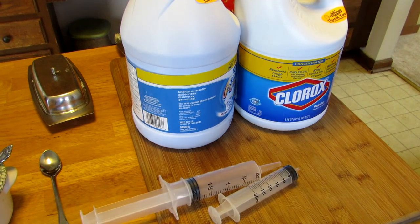And you want to smell the chlorine come out of the faucets and stuff. And then once you get the smell, really you should shut it down. And then the next day, flush it. Then you should be good to go.